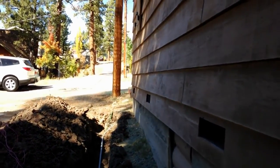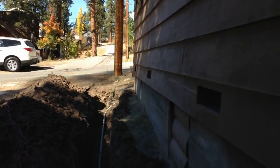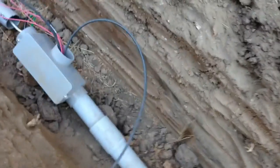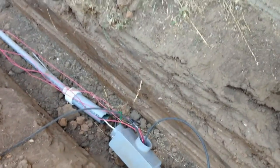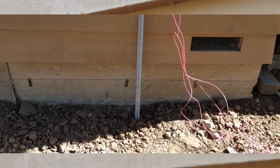We'll have to pigtail that end, and then that'll be run into the breaker panel up front. Here's the pre-wired DC wire — for now I'm going to throw it up in a junction box on the side of the cabin. Also coming out of this are those five wires for my trimetric battery monitor. I'll put a junction box here, connect them up, and then run the trimetric into the cabin so I can see and monitor it. On the other side, I've got the trench buried.